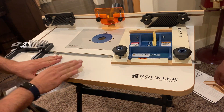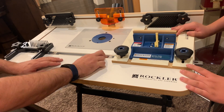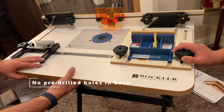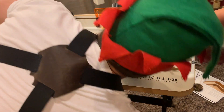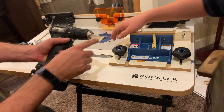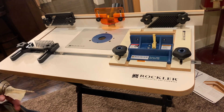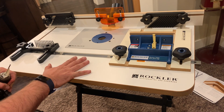Let's talk about the bummer things about this table. First of all, the table itself is awesome and amazing — there are lots of cool things about it. But one bummer: screwing it to the base, there are no pre-drilled holes at all. We had to drill ourselves, and I ended up having to put tape on my drill — because if you don't, you will puncture through the top of the table and get a big hole. I don't know why they don't pre-drill the holes.